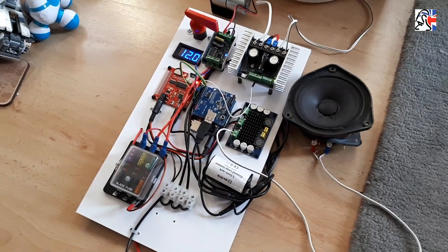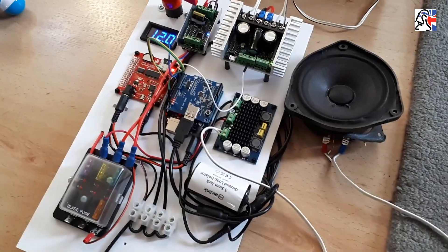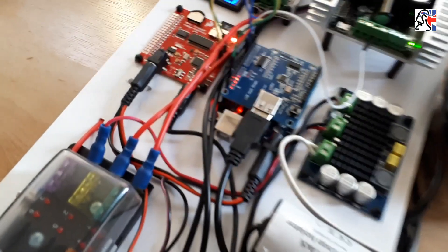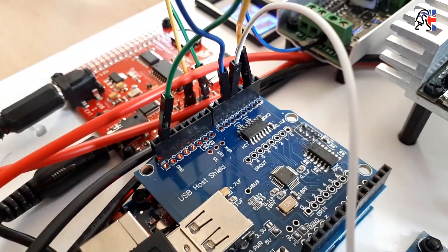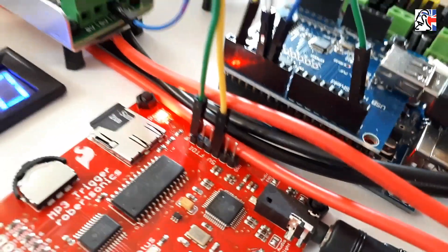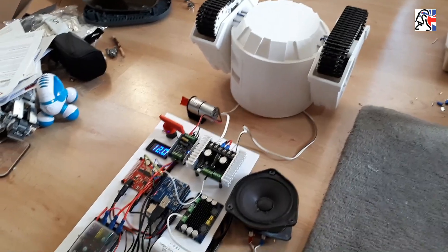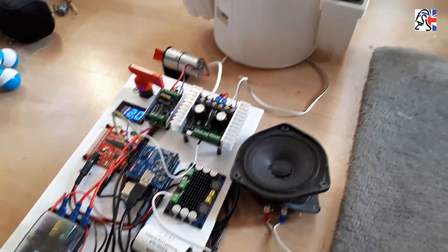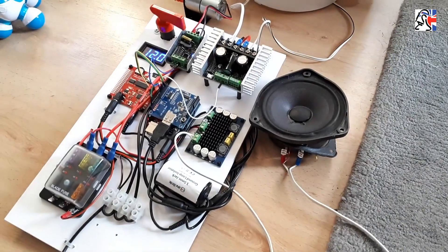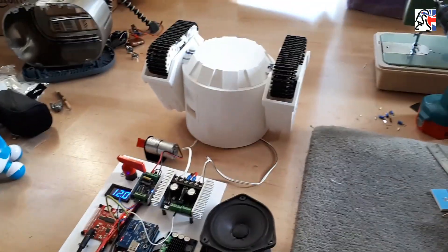That's about it really. This is a fairly basic build — it's about as basic as you're going to get, but there are other things you could do to bling it out. One thing I'd certainly recommend is to put some hot glue on any point where a pin goes into a socket, so all these pins will have a dab of hot glue on them just to stop them rattling out. Otherwise that's it — this system is ready to go, ready to be installed. Thanks very much for watching. I hope you've enjoyed this little series on how to build Padawan 360. Massive thanks and shout out to Dan Krause who came up with the Arduino sketch for the Xbox 360 controller, and thanks to all the original authors for the shadow system lineage. Speak to you all soon, bye for now.